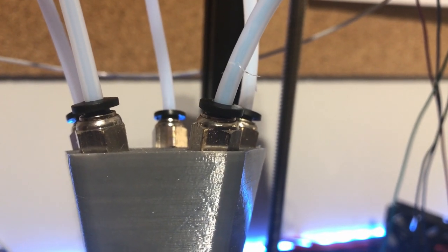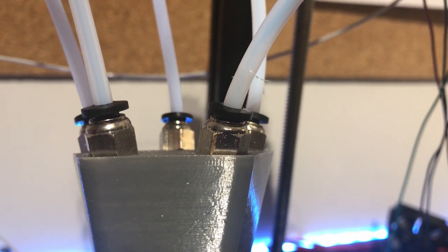To be safe with the calibration, you can look into the Bowden tube and retract until you can see the filament at the top of the merger. One important limitation: turning off the printer after calibrating won't save the value, because I'm only changing the variable in memory and it's not stored anywhere. A power cycle restores the old value. In the current state you need to reflash Marlin one last time with the correct value, but hopefully in the future I'll have time to store the value in EEPROM for boards that support it, so you'd only need to flash once.